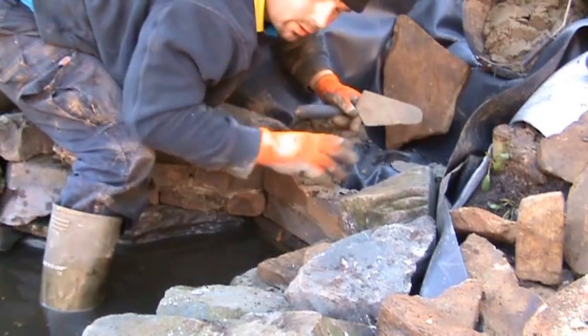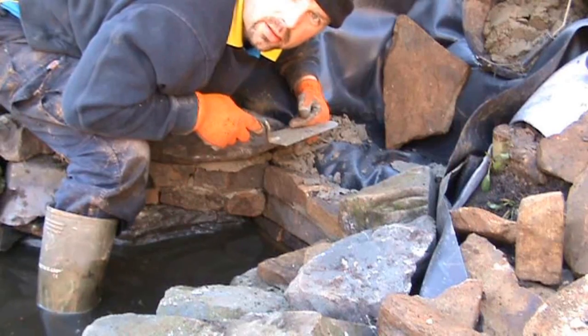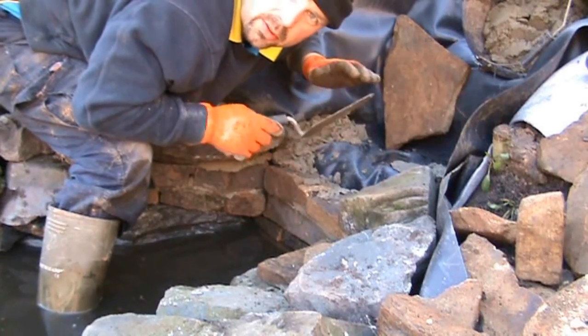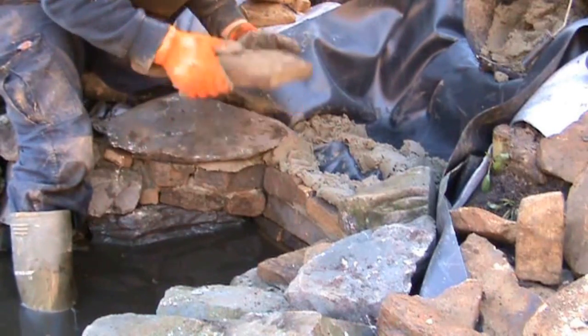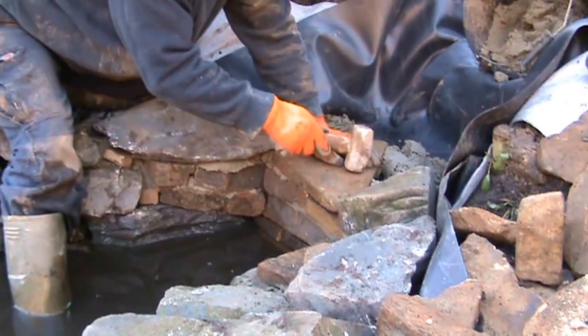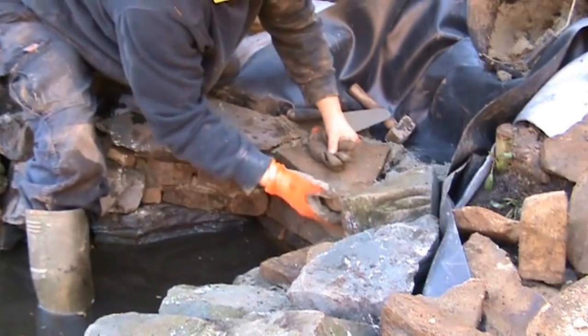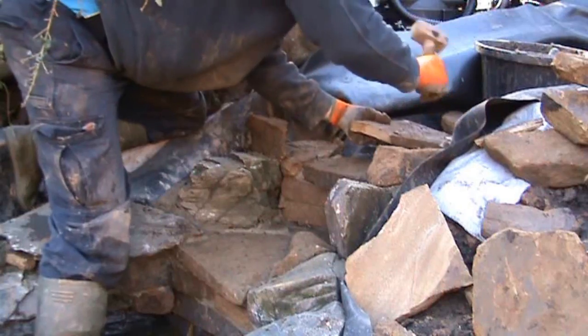Here we come to put the spillstone in. The two side pieces here are way higher than the spillstone is going to be. Good bed of mortar down and then the spillstone will sit nicely on our wall. The rest of the stream was built up by setting the steps from the spillstone, building a bit of a wall, retaining stones on the side, spill stones, taking it back from there, working it up — always from the bottom up.